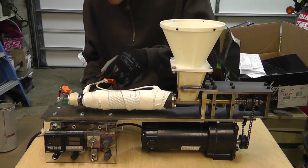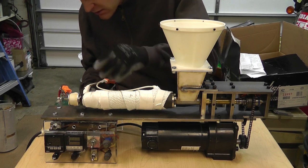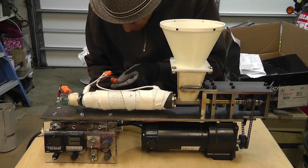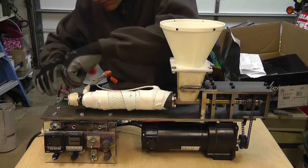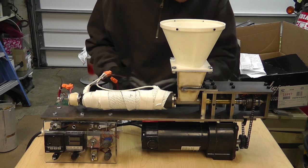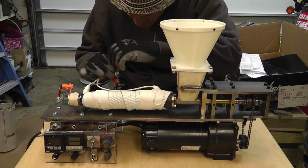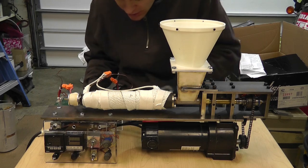The way I've done this is I put quick connectors on here — these are like 600-volt, 10-amp connectors for fluorescent lights. I did that so I can take this apart without having to mess around with anything else. The thermocouples I actually have twisted together and put in a junction box.